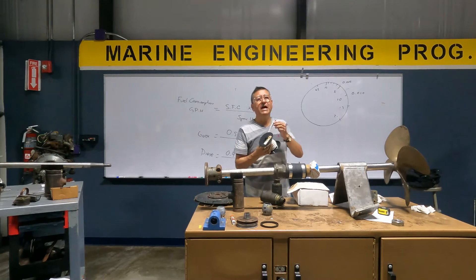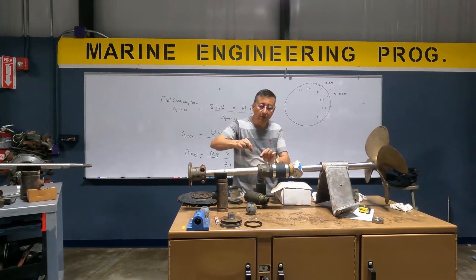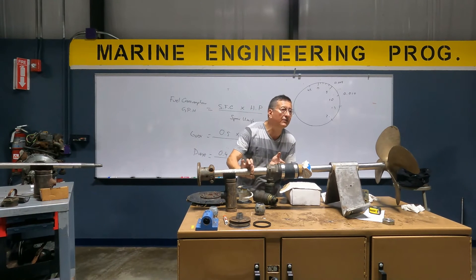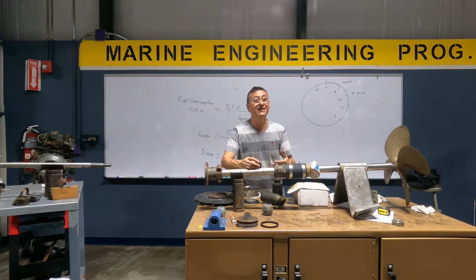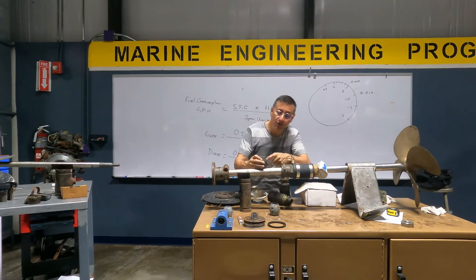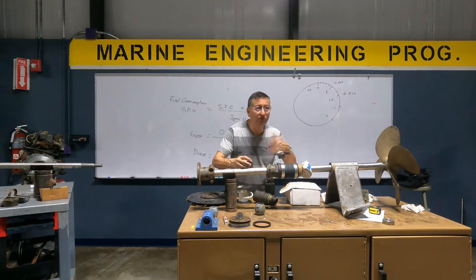You prepare and pre-cut three rings — offset — with a razor blade, exactly to the diameter of the shaft. You prepare three of those and you are ready. When you separate the nut — the nut moves out — water enters, the bilge pumps are working, the lights are on, and you are ready to remove all the old seal and introduce the new ones.